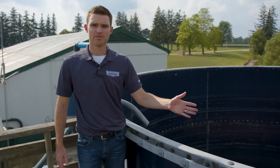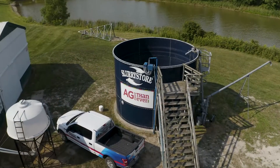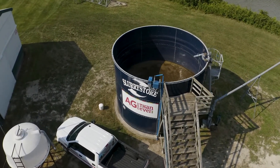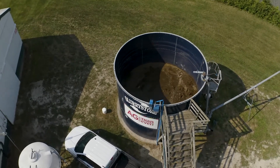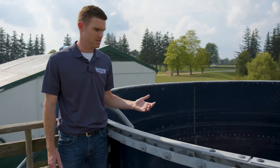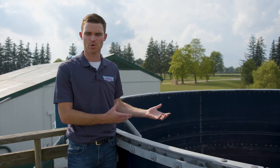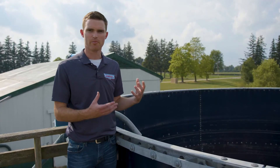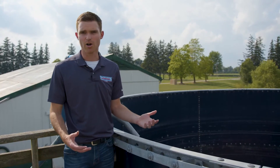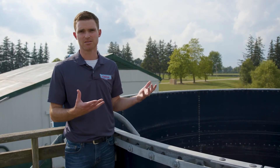Here we're standing on top of the manure tank as the manure is bubbling away, and the very first thing we notice is how many bubbles there are. We only have one section running inside this tank right now of five or six sections, and the entire tank is getting mixed, getting aerated, and we have a completely homogenous mixture inside there. It can be very easy for pumping whether you're going to a drag line or pumping out to your tank. The other thing we notice immediately is the odor — there's not really much of any to speak of, and that's because we have an anaerobic environment that has now been switched to aerobic because we've introduced oxygen to it. So we have much less odors, much less smell of methane or ammonia, making it a much more safer environment for humans, for the livestock, and for the environment because we're not pushing those greenhouse gases into the environment.